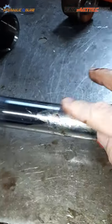Pretty rough, coarse emery paper, is that all we got? That's all we have. I've tried getting Roger to listen. I like to just curl it into a little roll, because there's less chance of you getting caught in the lathe. And you want to make sure that your shirt isn't anywhere near your lead screw, because that would end really badly. And that you're wearing safety glasses. You want to keep the apron and the tool post away, and make sure that when you put your finger in, you can quickly get out.